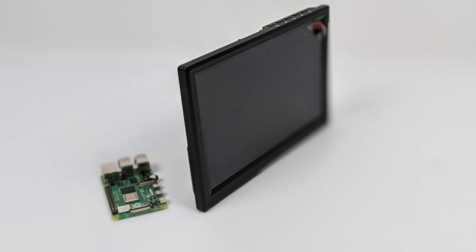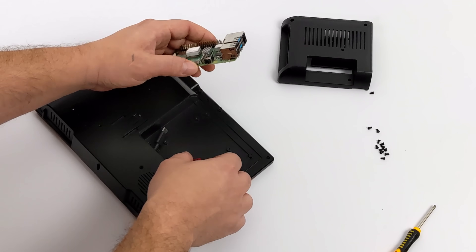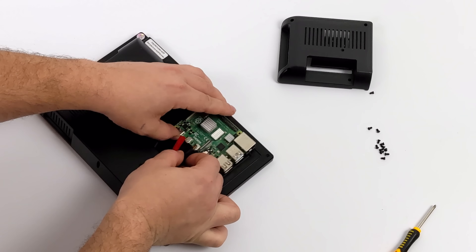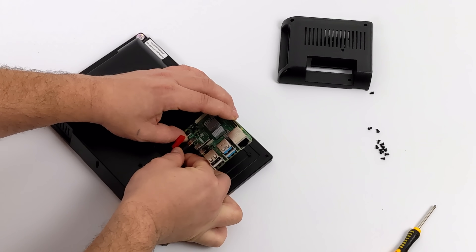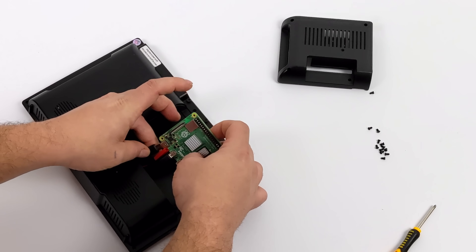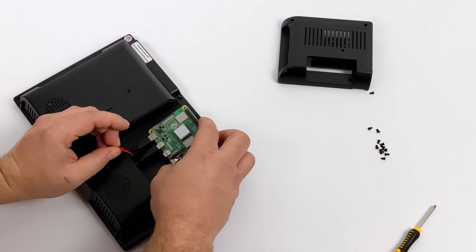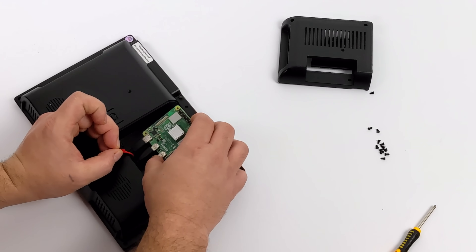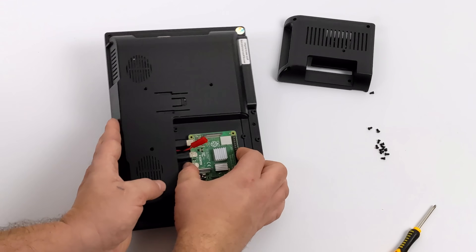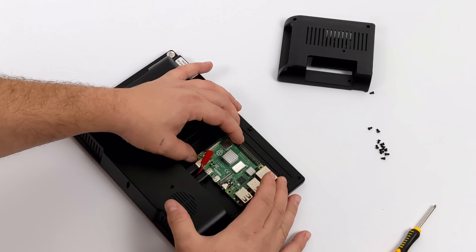Real quick, I'm just going to give you a rundown on how I put this together. It does come with heat sinks for the Raspberry Pi 4 — I've already applied them to the CPU, the RAM, and the Ethernet controller. I'm just going to plug in the micro HDMI to one of the micro HDMI connectors on the Raspberry Pi. Next up, I'll do my USB Type-C to power the unit, and basically this is just going to mount down with four screws. Before you assemble this, make sure you have your SD card installed because you cannot access it while this is all together. I'll just mount the Raspberry Pi down with four of the included screws.